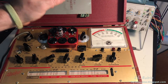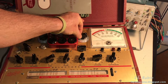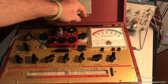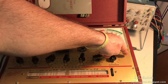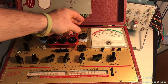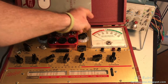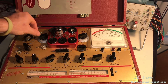The problem is this: the shunt control, dialed in for a specific number to get pass/fail, is perfectly fine. If it says 58 for the 12AX7 and you land on 58, it's good. But when you're actually measuring mutual conductance and want to hit 3000 — assuming perfectly calibrated — nobody's going to get right on 3000. What they should have done for measuring mutual conductance is a separate function switch, moved away from shunt, going to the 3000, 6000, and 15,000 positions without using the shunt knob to set those values.